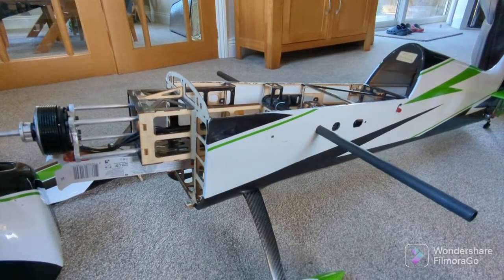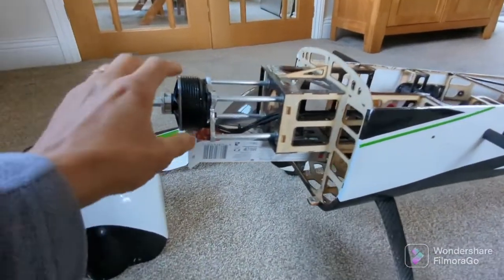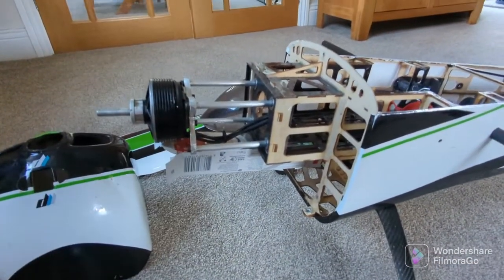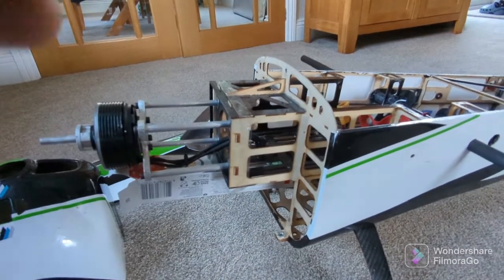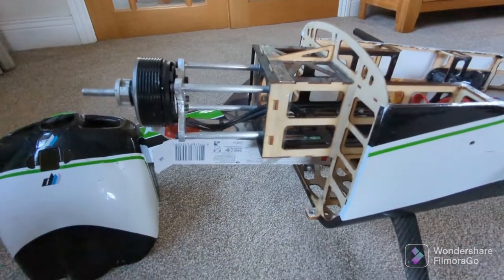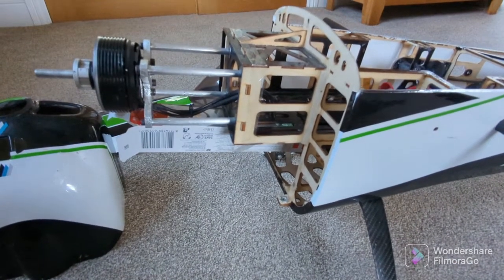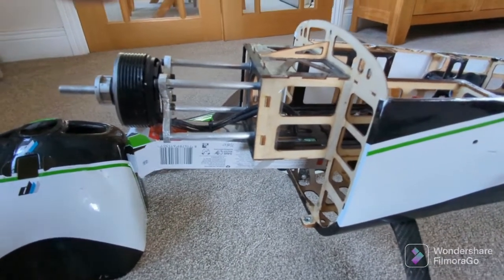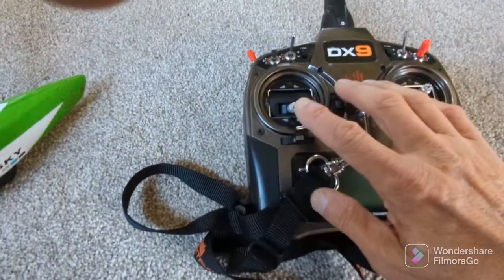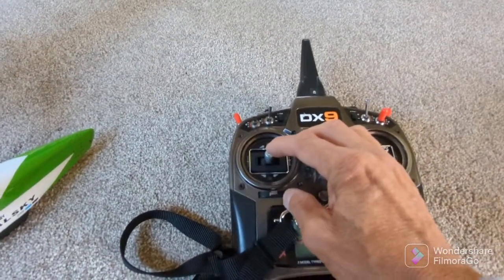And ripple voltage basically is, because these motors are being switched on and off with PWM signal, you get voltage spikes. Sorry, current spikes, because it drops its voltage, the current goes up, and you tend to get it mid throttle. You don't tend to get it at full throttle because it's not being turned on and off. The PWM signal's not going on and off. It's going on and off at the mid throttle.